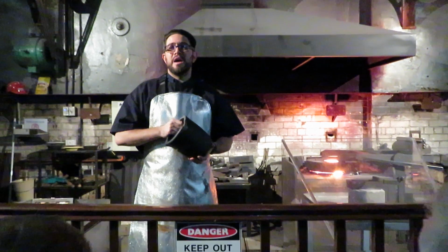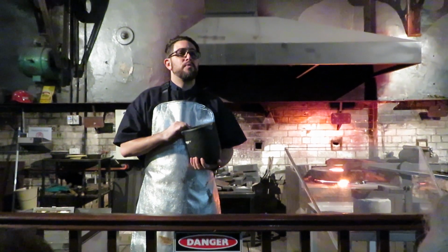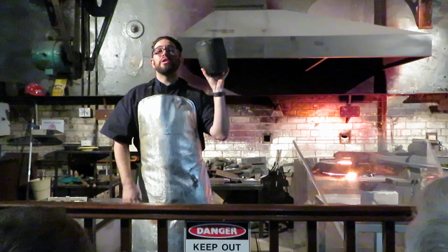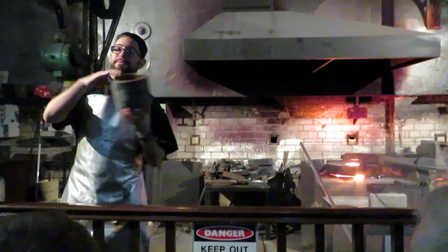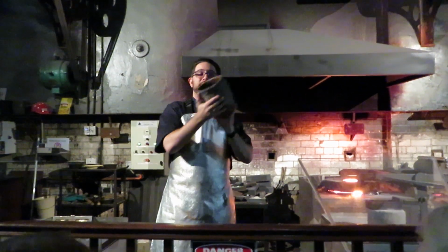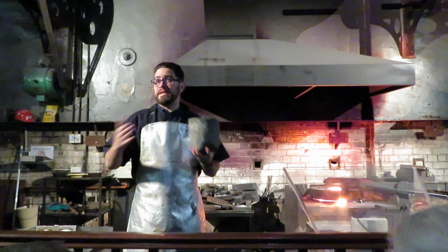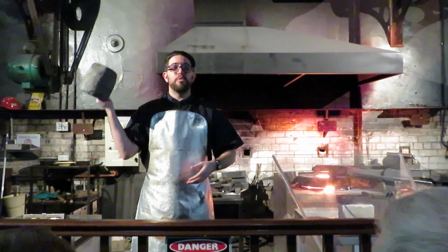Incredible temperatures. Now they cost the mint $110 to make each one of these pots. If we are very lucky, this pot will last for 2 weeks. Because after 2 weeks, they don't look like this anymore. They look like this. So you can see pretty clearly what this purpose-built material has done when exposed to that heat. It starts to crack and crumble. We lose the entire outer surface. Not ideal when you're pouring molten metal for something to fall apart on you. So after 2 weeks, we throw these away.